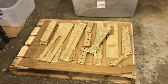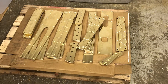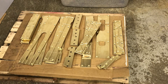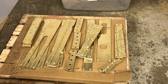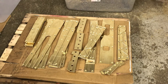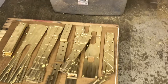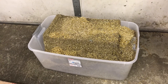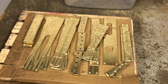This is several days of work. We've got a whole pallet full of wear plates that we've made. These go into different dies and machine parts, and you can see there are oil grooves machined in some of them. They all started out with that centrifugally cast finish on the surface of the bronze, and after machining we've got fixtures that we clamp them down to. Flathead screws clamp them down to fixtures to get our flatness done, because the plates we bolt them down to for final cuts are super flat. And the result of that pile of work is this tub full of bronze shavings, which will make its way to the recycler. These bars started out about a hundred thousandths oversize in all dimensions so you've got enough stock to finish up at the sizes you want.